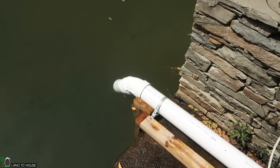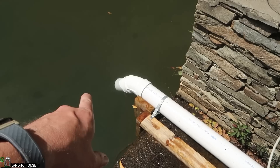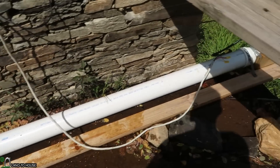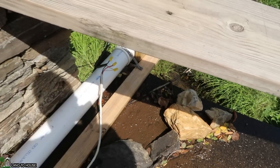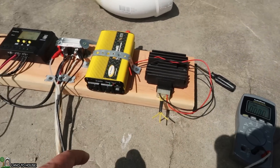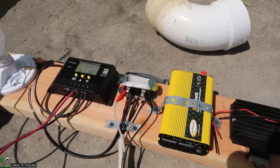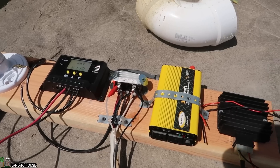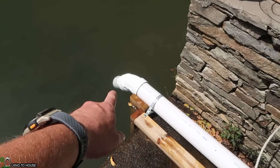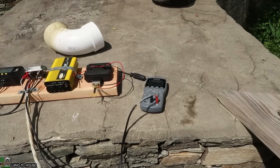I just added the 45-degree fitting to replace the 90 at the intake — I had to add one little piece of pipe going down to get further into the water. So let's go ahead and crank this back up. I've got it connected to the three-phase so we can now measure the open-circuit voltage on the rectifier, which should hopefully be higher than 66 volts from just increasing the flow rate with that 45 instead of a 90.